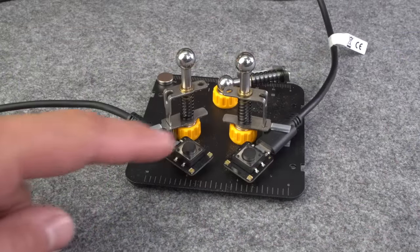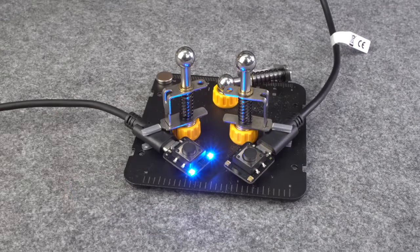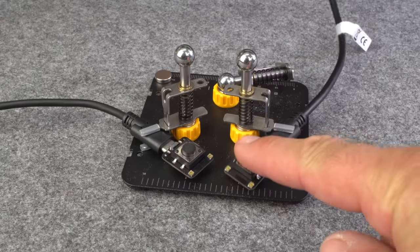In this example, I have configured two Picoclicks with ESP-NOW. The left device acts like the IoT button itself and the right one as a receiver or a bridge. The bridge doesn't need to be a Picoclick, it can be any ESP-based device.